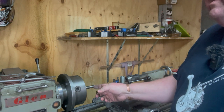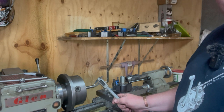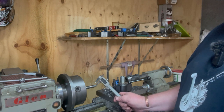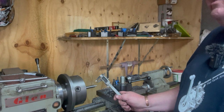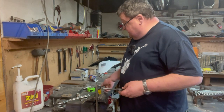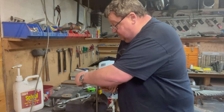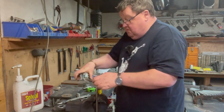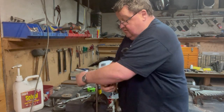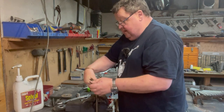Normally I'd cut a little relief at the bottom of where the threaded piece is going to be, but I reckon that'll be a weak point. Because the spring sits on it, I don't need the relief to tighten the nut right down. Let me cut this thread. A bit of tap magic on the shaft and a 5/16 cycle thread die — because I put the chamfer on the end of the piece it gives the die something to start on, and it's cutting really good.